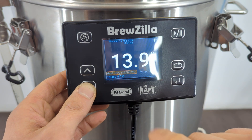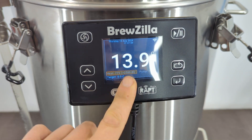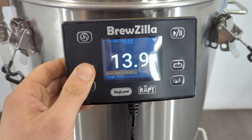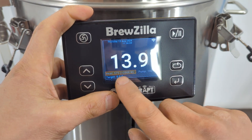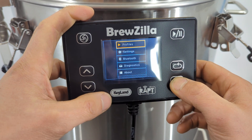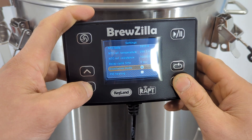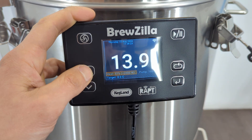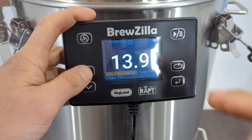There's going to be no fluctuation on any of these wattages where there's an equal sign, and you can basically choose those wattages knowing your power is always going to be consistent going into the base. Another thing you can do if you want to jump between only the ones with an equals sign: go into settings, then click on distillation mode and check that box, then return back to the home screen. What you'll see is that pressing up and down will only select element wattages where it's got fixed elements that you can turn on and off.